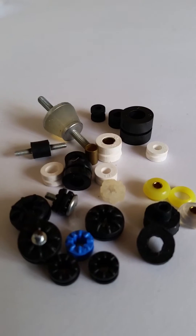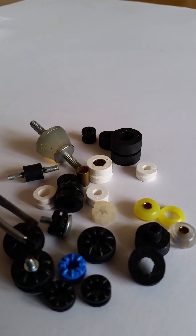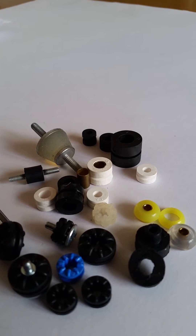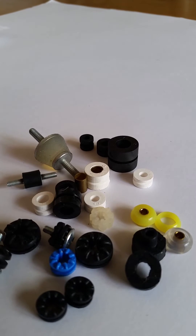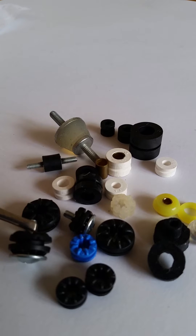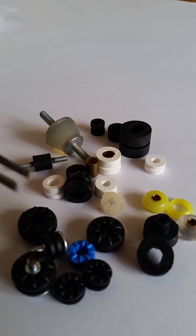We've got a good range of grommets for disc drives, mini disc drives, PCBs and other lightweight electronics. These thermoplastic grommets come in two core sizes, 9.5mm and 14mm diameter. They've got different plate thicknesses — that one's probably 1.2mm. We do 1.6mm and down to 1mm plate thickness, just for variable fixing depths of chassis and PCBs. We can also apply 6-32 and M3 fixing bolts for quick, easy fixing into the disc drive chassis or the PCB environment.